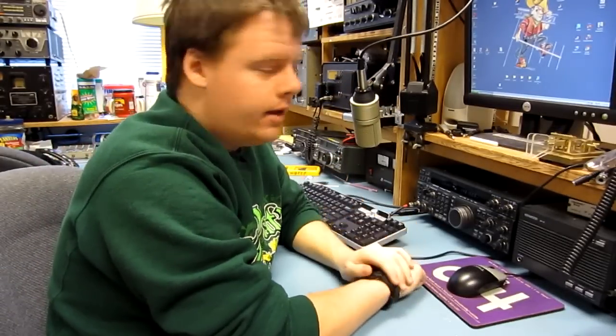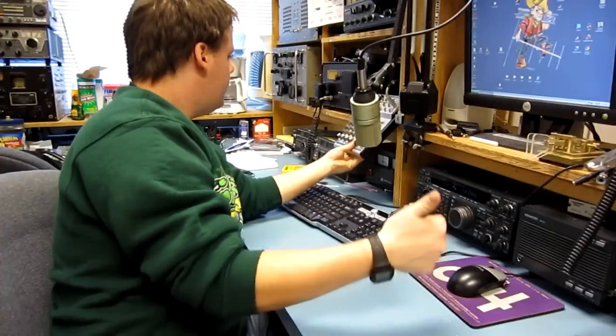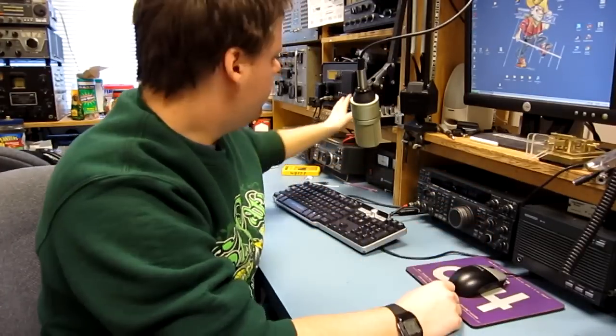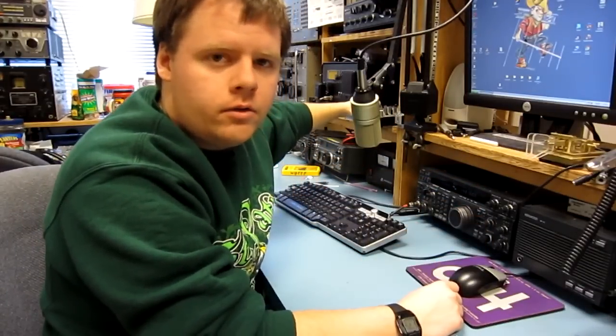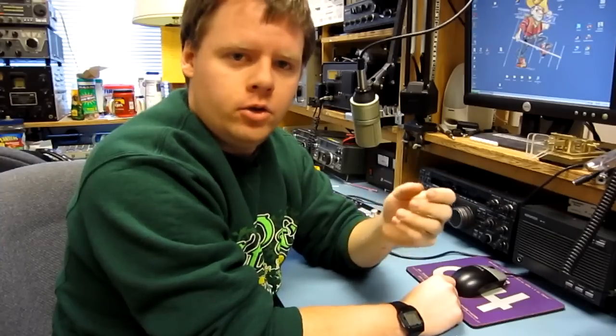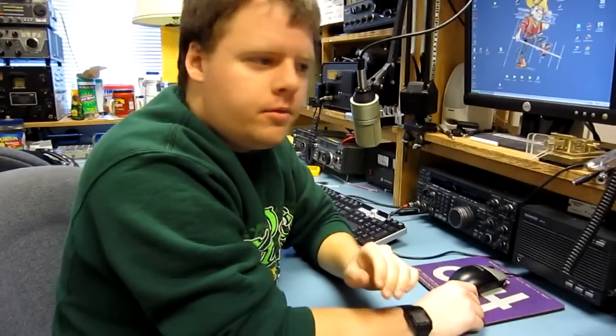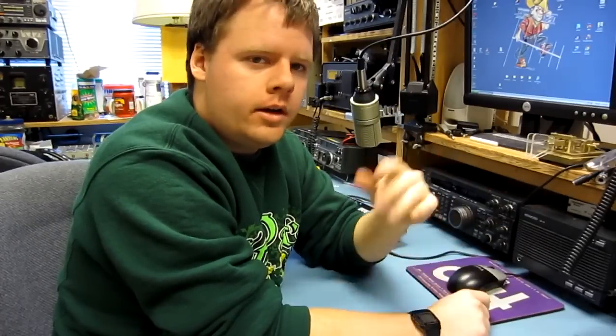And another cool thing you can do with a mixer, if you want to start sounding like a DXer or a broadcaster, a lot of mixers have equalization. This one in particular has equalization. It's 80 hertz, 2.5 kilohertz, and 12 kilohertz. If your mixer can hit 2.5 or 2 kilohertz or so, use that well, because 2.5 kilohertz is where your voice has most of its information. And so if you crank that up, and you make sure to articulate and not talk crazy loud or crazy quiet, you will bust over the pileups